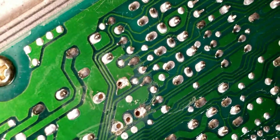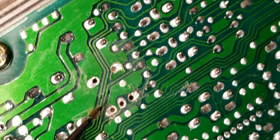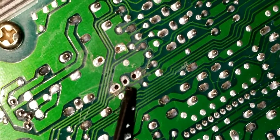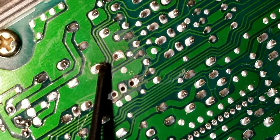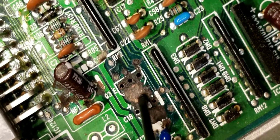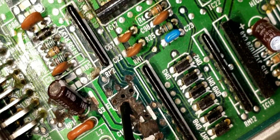The clear coating you see is like a protective urethane coating they put on the PCB boards — it's always good to put it back when you're done. If you can see, the actual circuit paths in the back of the board are okay. If you flip it around to the front, it looks like it's screwed, but it's not. This is just the printed side where the components would go, so I care less about this side.